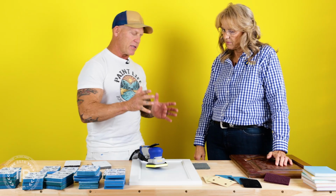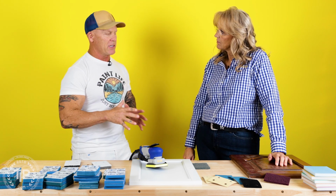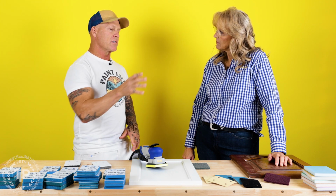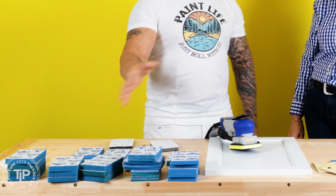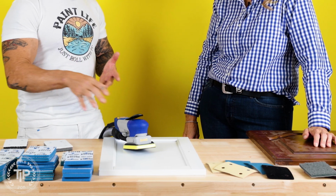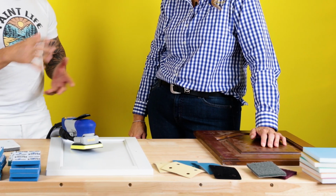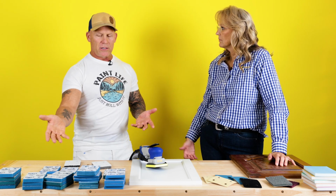Right. That's interesting. Now I've learned something completely new, because there was one cabinet job I ran into, and I think I know now why I got the swirls: I wasn't using a pad saver to begin with. I was using just sponges to sand between coats, or I might even have used Film Tech, which was causing me to get some walking and some swirls. And I was trying to eliminate the swirls with super fine sponges, but that's probably not the best thing to do, right?